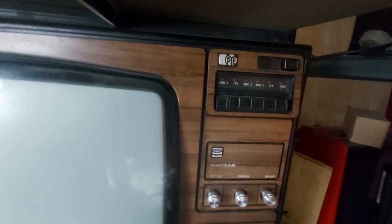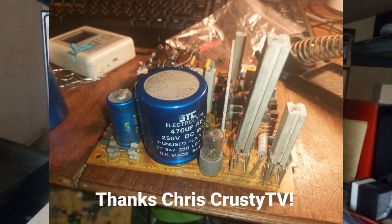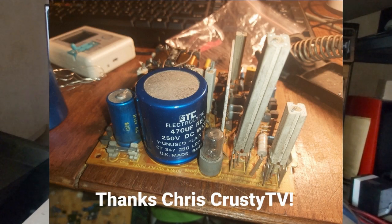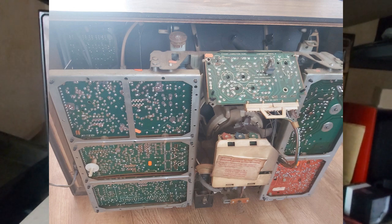1978 Pye CT450, better known as the Philips G11, as by this time Pye was owned by Philips and was probably more of a brand name. This is exactly the same TV my parents had when I was a kid. I've anticipated a few stock faults, such as the bad deflection chip sockets, replacing the HT smoothing capacitor. Luckily it wasn't a red one, but I still didn't quite trust it. And generally sorting out some dry joints. So yeah, let's get some power in this and see what happens.